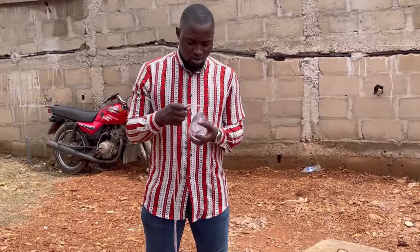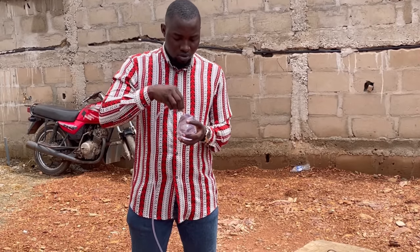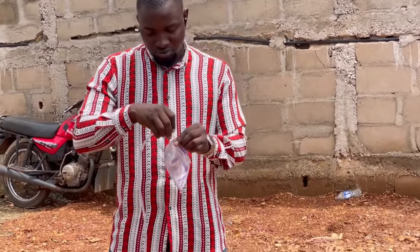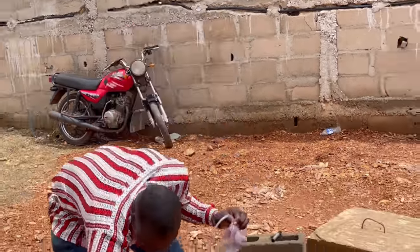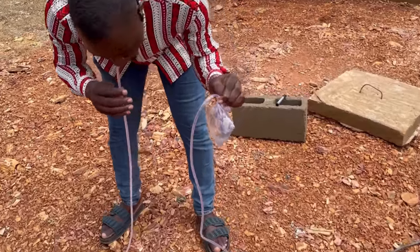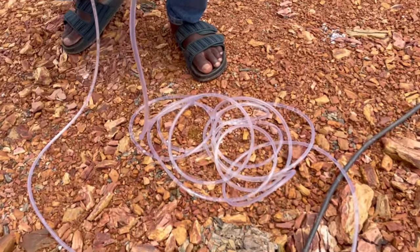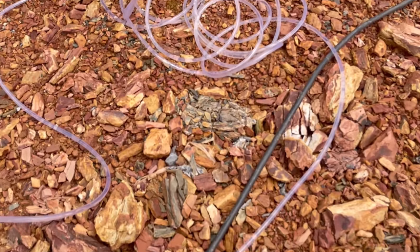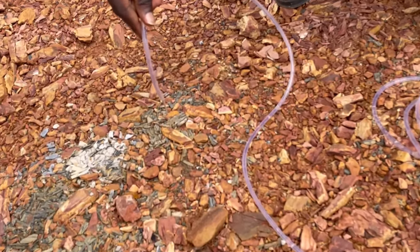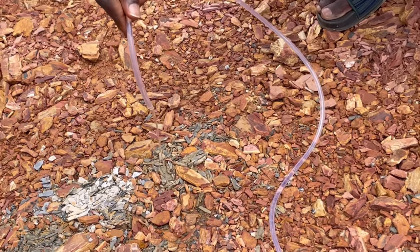In order to use this instrument, clean water is provided. Once water is provided, one end of the tube is inserted in the water, while the other free end is sucked in order to apply pressure on the tube to draw the water towards the sucked end. While the water is being sucked, the sucked end is dropped on the ground to allow free flow of water from the source to the outlet, allowing a complete flushing of air bubbles within the tube,